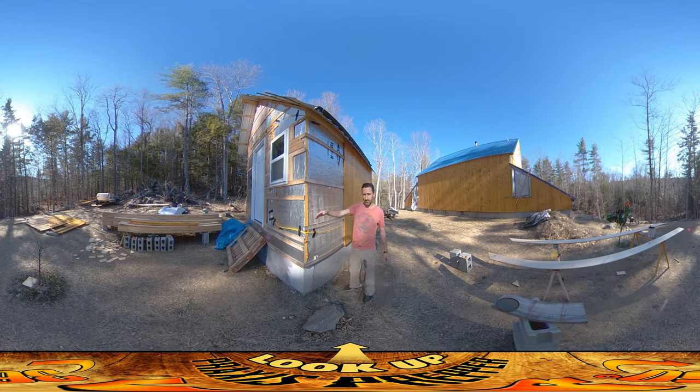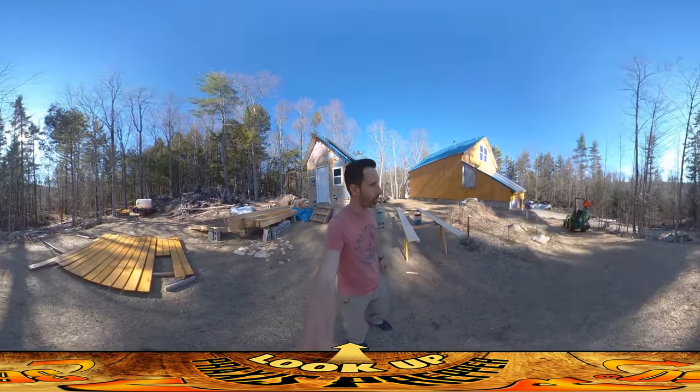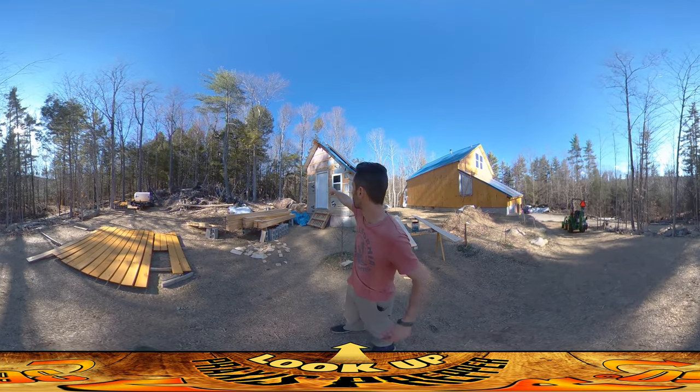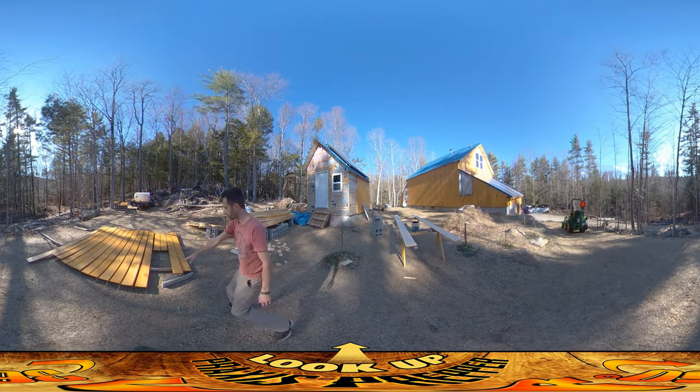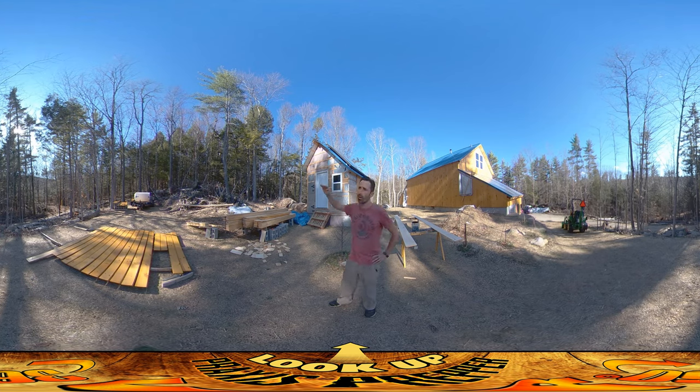I think it'll probably be a few short and I'll need to stain up a few more. This pile back here is a bunch of boards that are actually going on the north wall, which I haven't even started on. All these boards right here are about 10 feet long, and as I've been going through the pile I've been cutting those to length — they're all ready to go up. But I really have to wait until I get across the east wall first, because you have to work the corner pieces in conjunction with each other. So I can't start the north wall until this wall is up, so I can do that last piece and get them together for a nice tight seam.